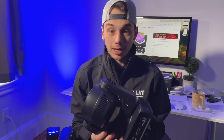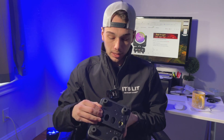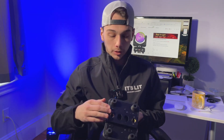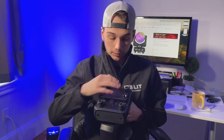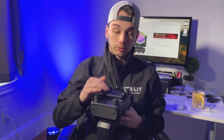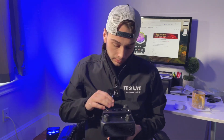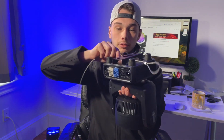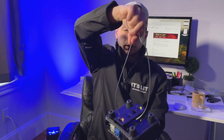One of the first things I'm noticing as a lighting professional is on the bottom there is a section for the clamp that has these two holes in it, which I believe is where you would normally feed a safety cable. At least that's what I've done in the past, because there's no safety loop on this, which is fairly common nowadays. Usually the safety loops have to be removable because of that. So here's a safety cable of mine — if you wanted, you could go right through under here, which is pretty nice.